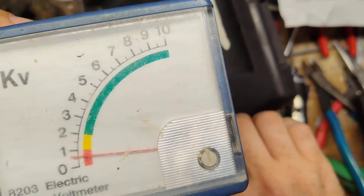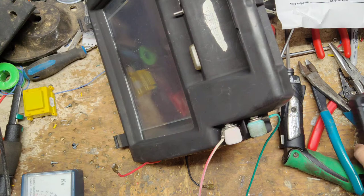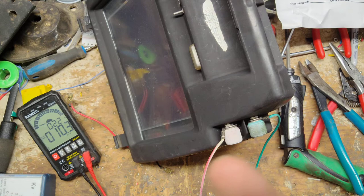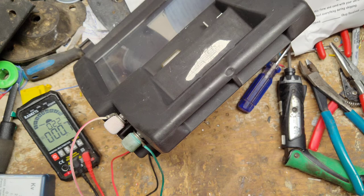I'm not getting very much out — you can see the needle pulsing. It is clicking. If it wasn't clicking we'd have more issues. Let's turn the unit off. We're leaving on DC volts and we're going to check the output of the solar panel. You might be able to do it under overhead shop lights, but you may have to tilt it up closer to the lights, or do it outside on a somewhat sunny day. This solar panel through the battery wires, unit turned off, should read about seven volts. Reading 5.8 right now.